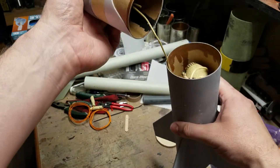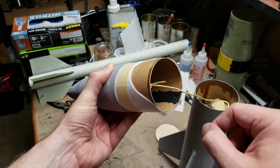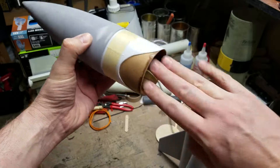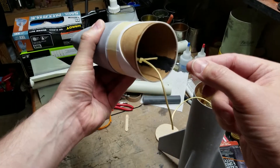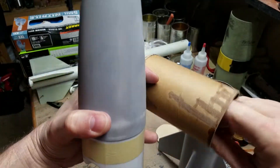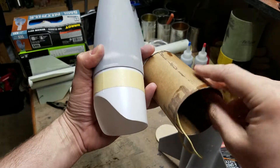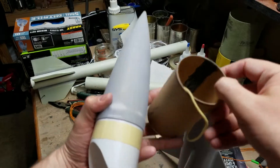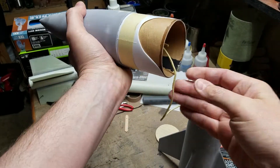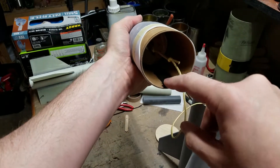What I did — what a lot of people do — is I cut the taper off the nose cone, and you can see how much room I have in there. All I did is I took a Lock Precision three inch thin wall coupler and a bulkhead, split the coupler down the middle, cut out a section, grafted it back together with some thin CA, and then used the inside of the nose cone as essentially the pattern, and put some six minute JB weld down the inside.